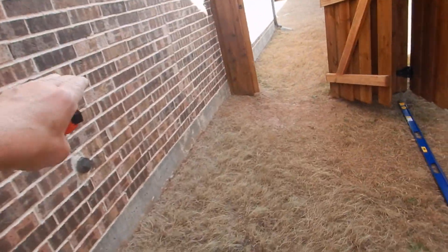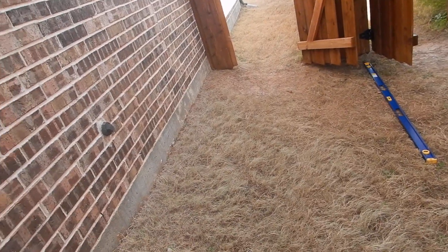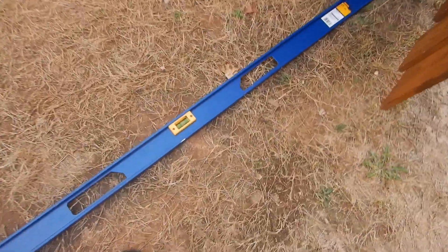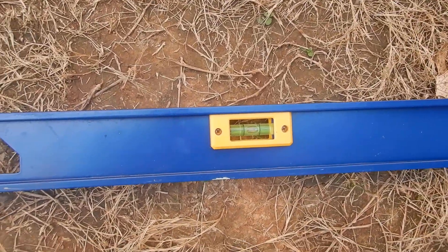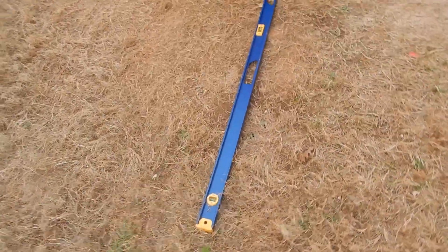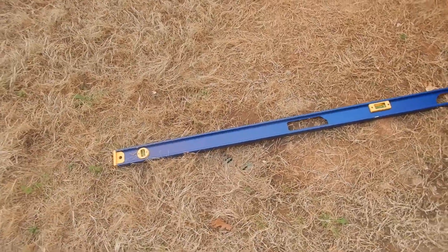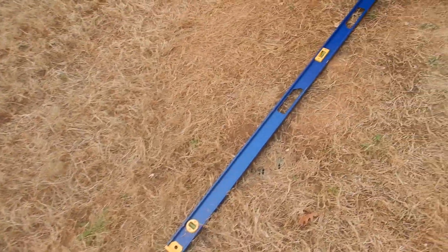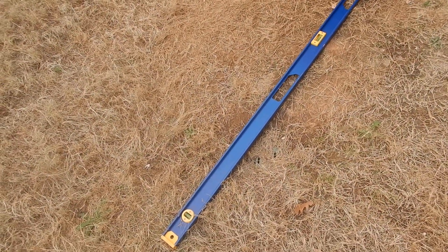This is grading, and builders get that most of the time. But this is drainage — and this is level. Level is not drainage. You can see the green hue here; moss is growing. Some builders will tell you if it doesn't dry within 48 or 72 hours, they consider that the problem. But the problem with that is — that's evaporation, not drainage.